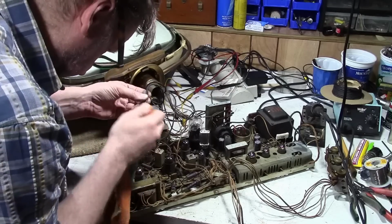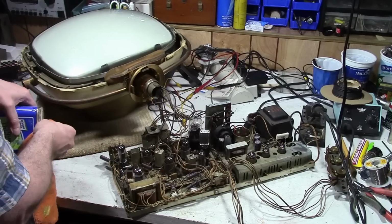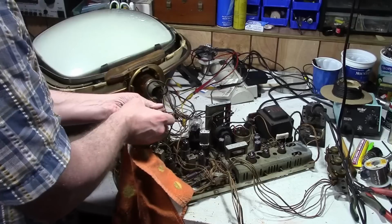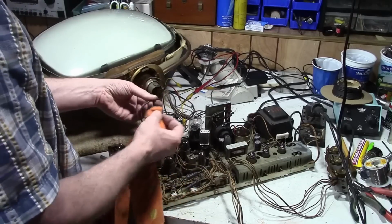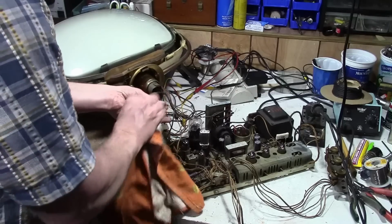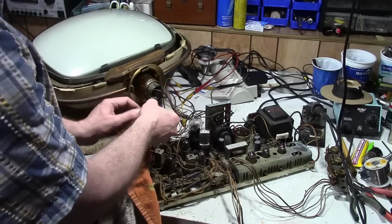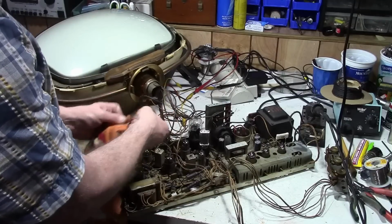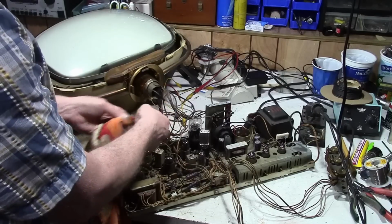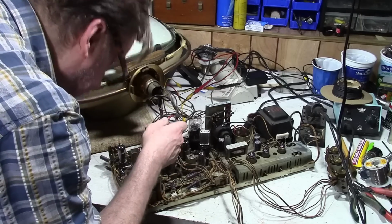So there's goo that accumulates on old plastic wires. As near as I can figure, it's the plasticizer leaching out of the plastic. It's very sticky, and that's why dirt adheres to it so well. So this wire should be bright red, but it's black from all the junk on it. Hardly unique to Predictas. That Admiral I worked on recently, a 21-inch Admiral, was incredibly sticky all over.